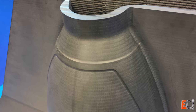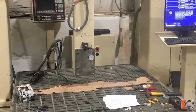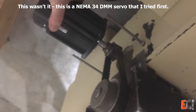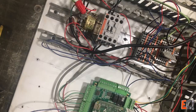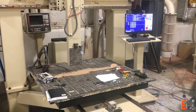I had a 5-axis for trimming but I needed a way to make large-scale prints. Fortunately I had an old Motion Master CNC router frame with a 5 by 5 foot table and 3 feet of Z-travel. I got a Centroid Acorn CNC controller, PC, and some very large NEMA 42 servo stepper motors and set up the router to do 3-axis motion.